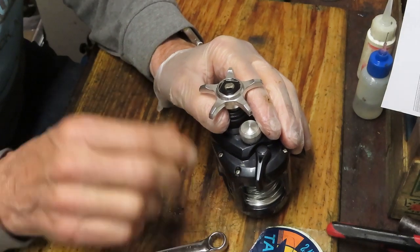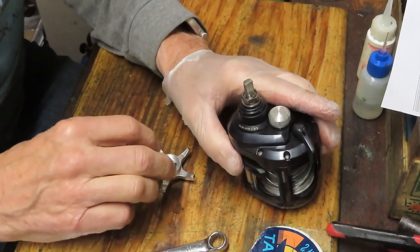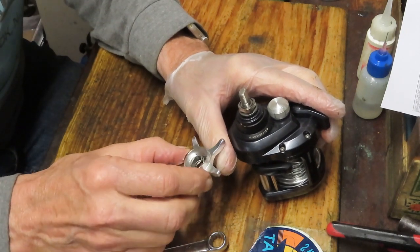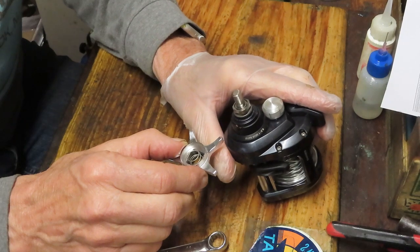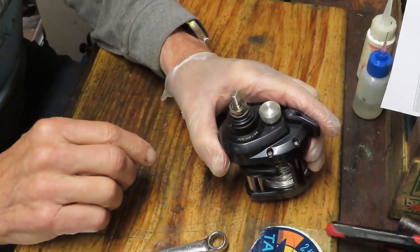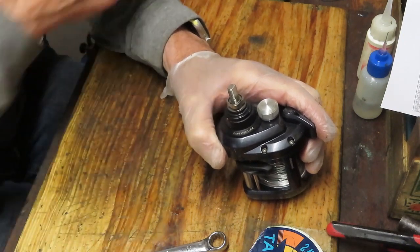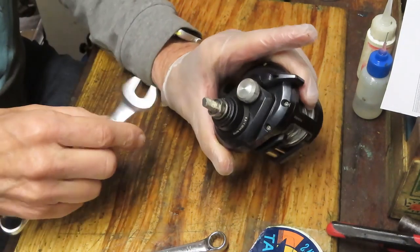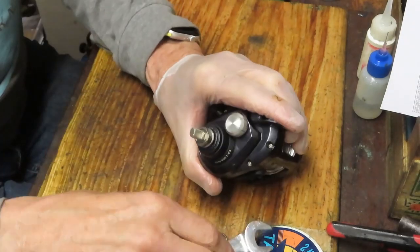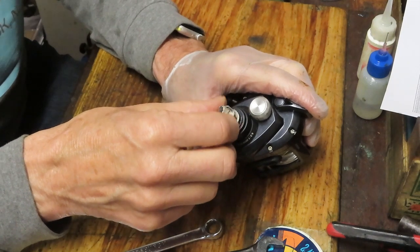Okay, this one probably is not the same because this is lifting up. Then we have a spring. So take pictures here, even if you have that assembly or schematic. Take the pictures. It gives you the orientation of the pieces and parts, how they came off, and more importantly, when it's time for you to put them back together again, it shows you how to do that as a reference point, so that if you're stuck, you can go and look at your pictures like now and see, oh, okay, the rim on this adjuster nut has an indent in it that's going to accept the spring. That's the orientation that you want to put that piece down in.